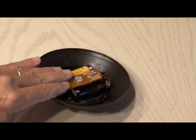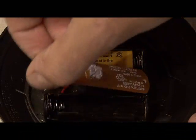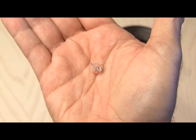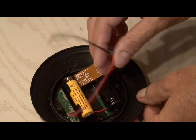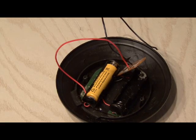When it's all done, we need to get to our solar lamp, flip it over. We've already removed the circuit board because we need to locate the LED, which we'll be removing and hanging onto because we're going to use it in our new circuit. Solder in two wires connected to the old LED location on the yard light, as those will go to our new circuit's positive and negative connections.